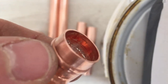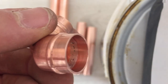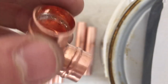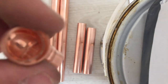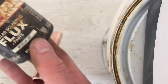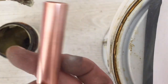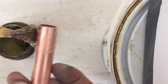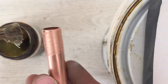Get in with the wire wool and abrade the inside of the fittings as well and clean them up, because that will make sure the fitting between both materials is very good. Do that for all of the fittings. Once you've done that, instead of being shiny on the inside it should be a dull colour, and your aim is to get as much dull colour as possible because that's where the solder will stick to. Do that for all the fittings and then put flux onto the ends — regular soldering flux paste — and put them in position ready for soldering.